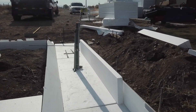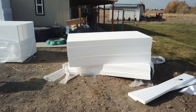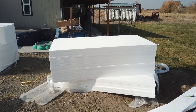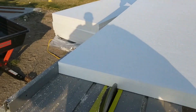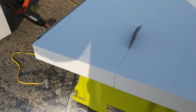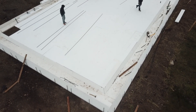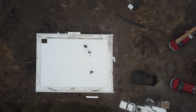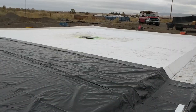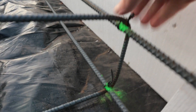You can see the footings are only about 12 inches deeper than the slab. This is just regular styrofoam — we had a manufacturer here locally make it for us and cut it to our specifications. If we needed to, we could rip some down quickly on the table saw on site. My friend Josh Ruby helped me a lot. He's an engineer and this is his system that he designed and has used several times. I was glad to have him helping me with the ICF process as well as the foundation design and preparation. We put down plastic as a vapor barrier, and on top of that we put rebar to reinforce the concrete and strengthen it.